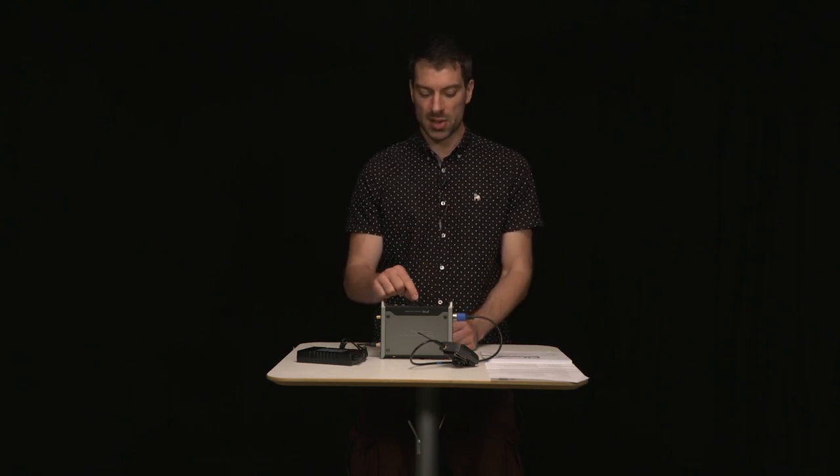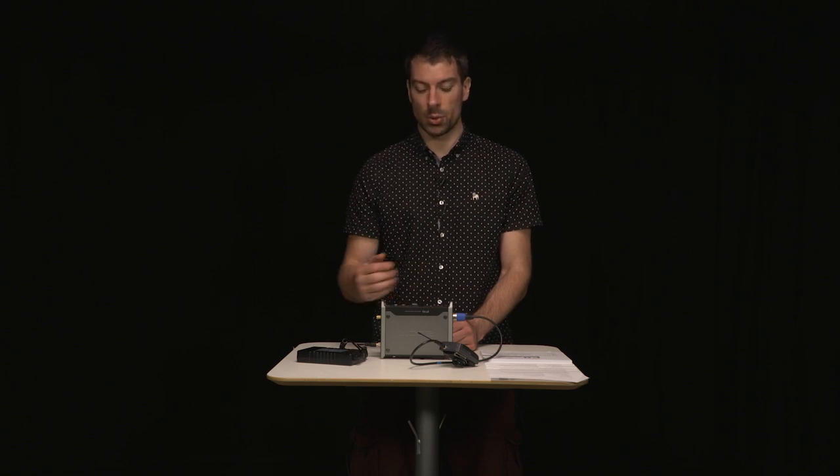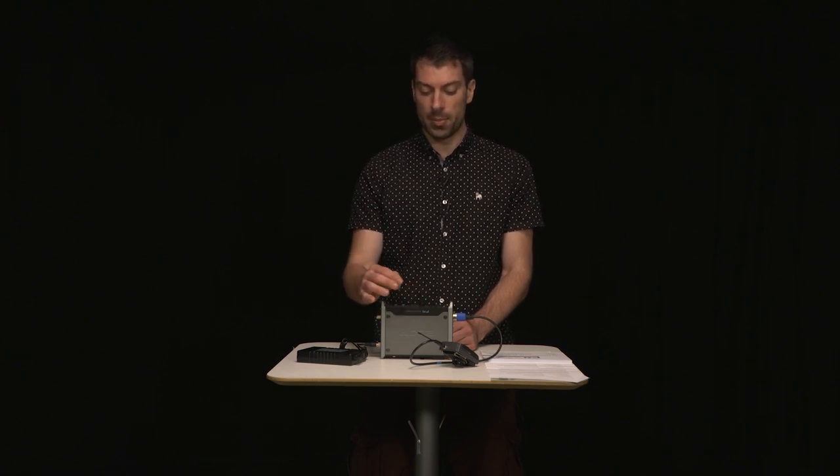Another problem is that perhaps they have the headphone volume set too high and they're not conscious of that. And consequently, they are recording too low an input signal and their signal to noise ratio is bad because the input gain of the mic is so low. They've got the headphone cranked. It sounds fine in their ears, but there's a bit of noise going on there because they're not doing things in a logical order. You always set the input gain to reach that sort of Goldilocks zone as an approximation before you set that output headphone volume.